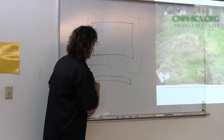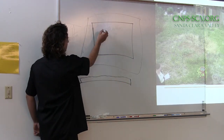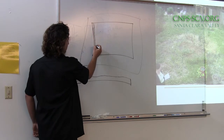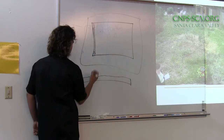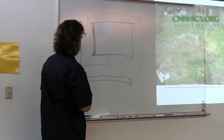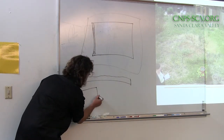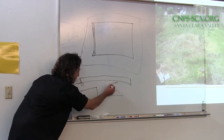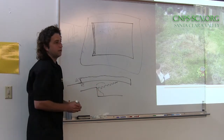And so to keep this from happening, you come around the sides. So this is concrete, and this is the grass. Trench a little spot next to it, 4 inches wide and 4 inches deep. What that does is allow for a bit of a transition for the concrete. So here's the concrete, and here's where you dug that little trench down. It allows the mulch to have a slow way to transition down and fill in this little gap where you trenched, versus it being above the concrete and spilling over all the time.